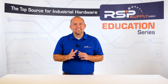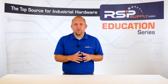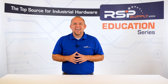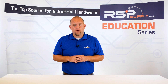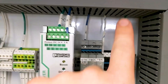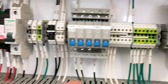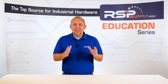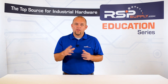In some cases it is necessary to isolate AC ground from DC ground. But in the case of most industrial control panels it is common to see these two types of powers share a common ground. This is done by tying the DC negative portion of the DC bus to the AC ground bus within the control panel. This again allows everything, including all AC and DC circuits, to be tied back to one single location within the panel.